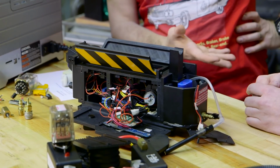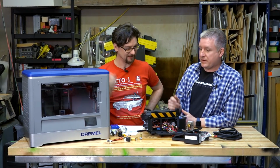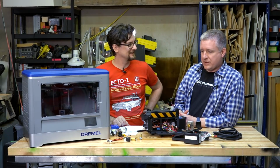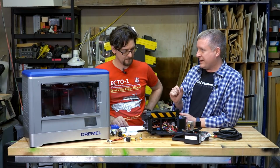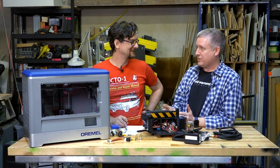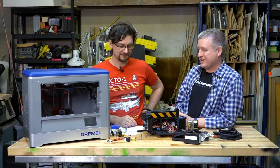And the motor was one of the last things we added, and it was a bit of a challenge getting it all working. But for you, it was certainly a huge challenge. For the code, it was a simple couple lines. Yeah. But what was a challenge were these flasher lights. Remember at the very end we were trying to get those synced up, and something was not working. Yeah. We were trying to use this music board to control that, and something is very, very picky about how you send those signals. Whether the pin has to be set to input or output, and you can't leave it set how you want it. You can't use a variable to talk to the pin and this kind of thing. And it was just very, very frustrating, but we got through it and it's all done. It was about half a day of troubleshooting. Yeah, it was really annoying.